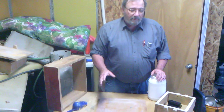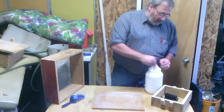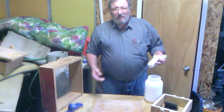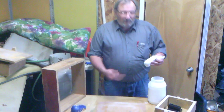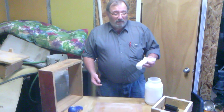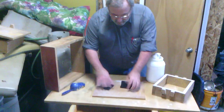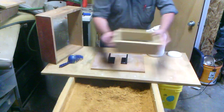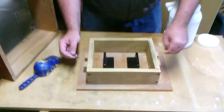When we go to ram up the sand, it will stick to itself, so we need something to separate it so it won't stick to the pattern or to itself. I use a commercial release agent. You can use talcum powder, diatomaceous earth, or very fine silica sand, but a ten-pound container from a casting supply will last forever and works great. We're going to start by placing our patterns down, and I want to set them about like this with enough space between them for the sprue.